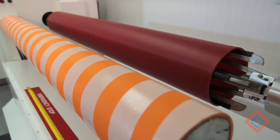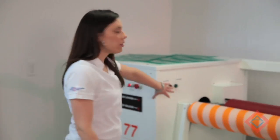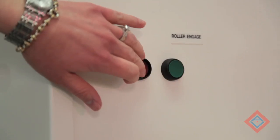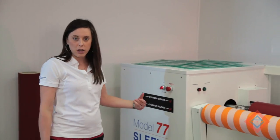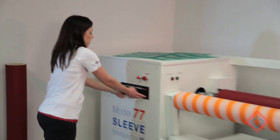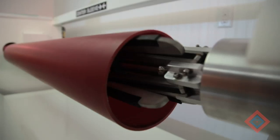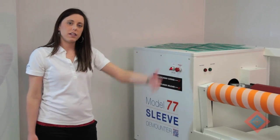Our plates and our tape have been removed from our sleeve. We're now going to get the sleeve out of the unit. I have to first release the assist roller, then release the air from the cylinder — I'm going to do that the same way we expanded it, hitting both buttons at the same time on the second unit. Now the sleeve is disengaged and I can remove it off the end of the unit.